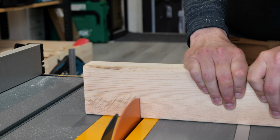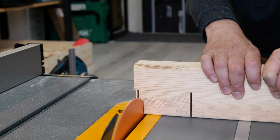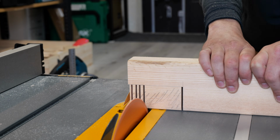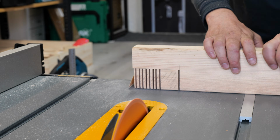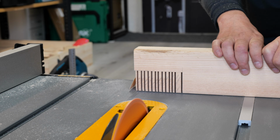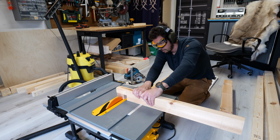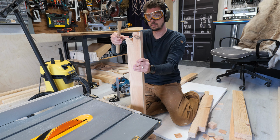I wanted a clean look, no screws in sight, so I cut dados at the top and bottom of each leg, locking them behind the frame. In the EU, dado blades are banned for table saws, safety laws, but CMT makes one for industrial use. But mine didn't arrive in time, so I scored the dados with my 80-tooth 2.8mm kerf CMT blade. Slow, yes, but paired with the chisel and some sandpaper, perfect fit. Turned out just the way I wanted.